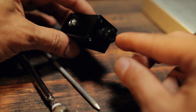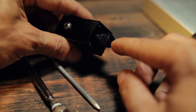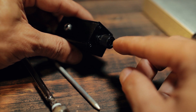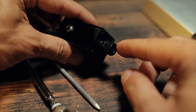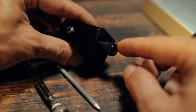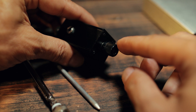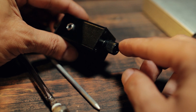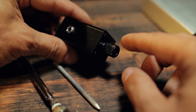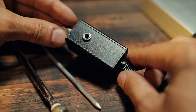With the banana plug you can use a longer wire that will connect to a proper grounding. If you have a special permanent location where you'll install this receiver for recordings, you can probably drive a long copper pipe or zinc pipe into the ground for proper grounding. And if you keep that place humid — putting some water into the ground now and then, or right before using the receiver — it will clearly improve the performance and the sound you can receive.